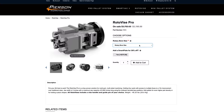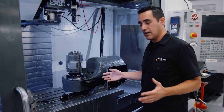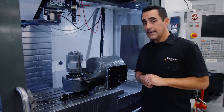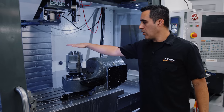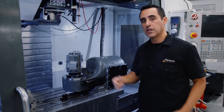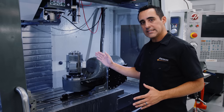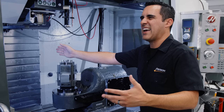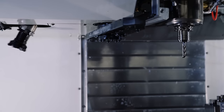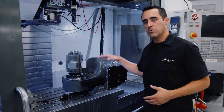The bore is two inches. When a customer purchases our Roto-Vice, you just specify a two-inch guide pin at checkout. It mates down with six bolts all the way around — it is a true bolt-and-go solution. Now, are there any gotchas? Yes. From a mechanical standpoint, you do not want to have your Roto-Vice directly under the spindle if you're machining in the vertical configuration and then do a tool change. The solution is in the Haas control: you can specify a known tool change location so it moves the table out of the way, or command it to always change tools at A90 so the Roto-Vice lays flat and doesn't protrude as much.